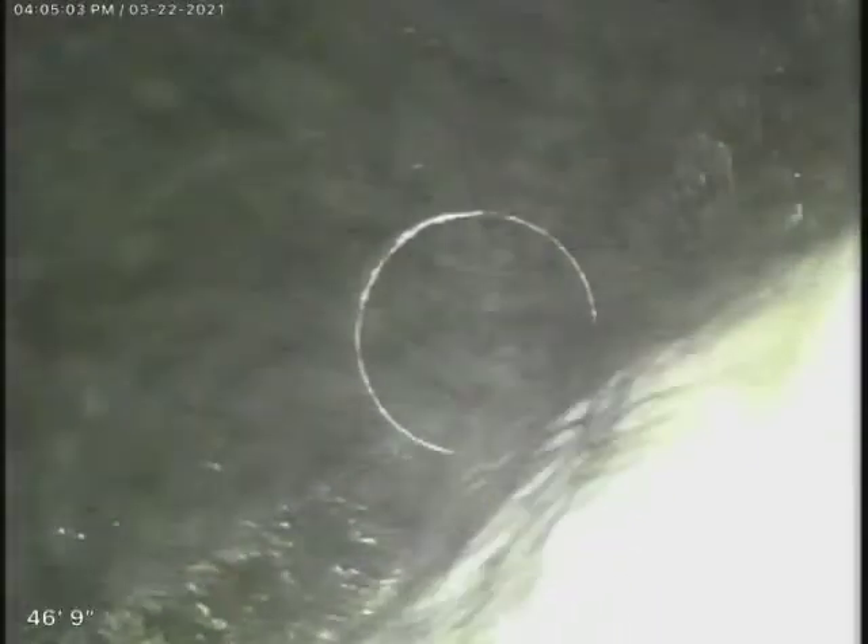It's really humid in the pipe right now — that's why there's a lot of cloudiness. We're videoing from the city out. You'll still see that when we come out, we're in the same location. So it's good to know that this lateral here is roughly 100 feet out to the city from the clean-out.